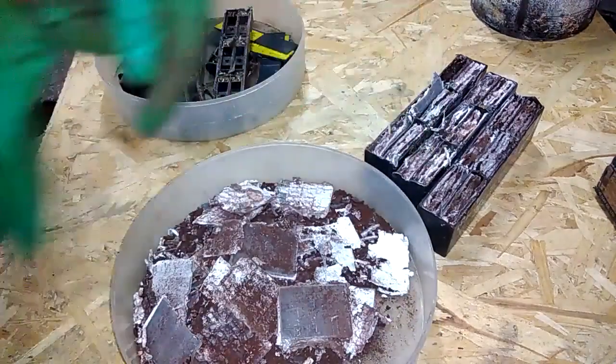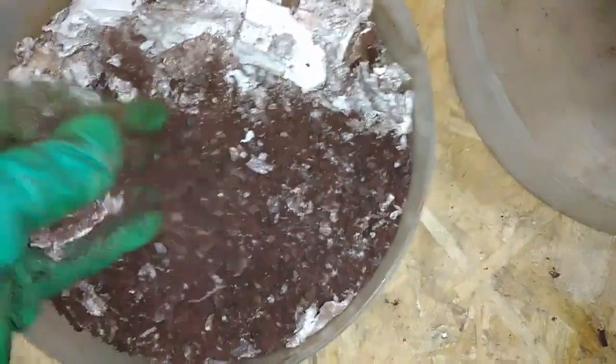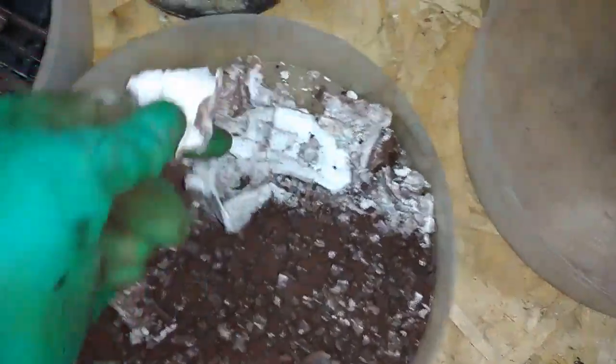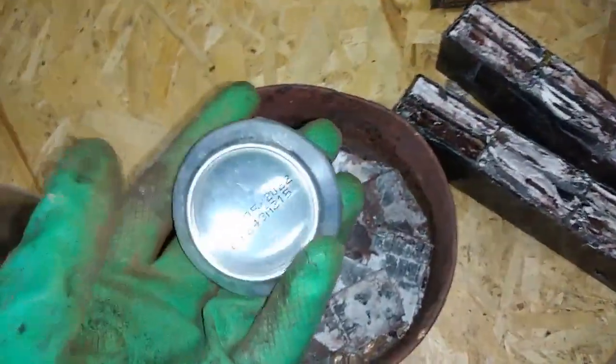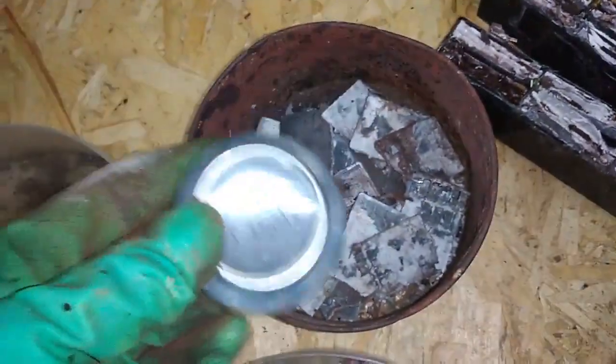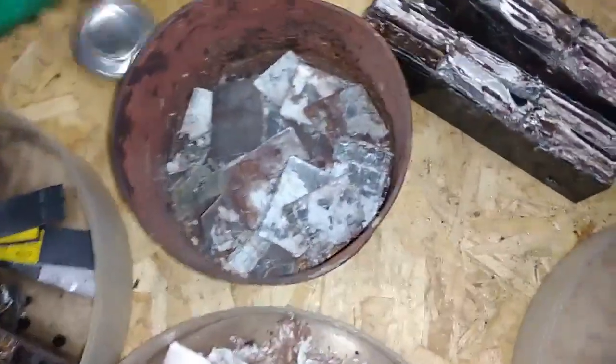Okay right now I'm gonna remove all the lead from that. Okay guys, so I removed everything from two batteries. In this metal dish I got the lead from the batteries, and this is just junk — this is some dry electrolyte and some paper, so this goes to waste together with the plastic. This lead I will put in the furnace and I will make some nice coin bars. To make the coin bars I use as a mold just the bottom from an aluminum can. I just put that in the stove and when all the lead is melted I pour it into a couple of these and I have nice coin bars from that lead.